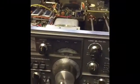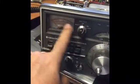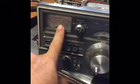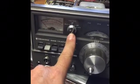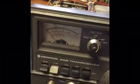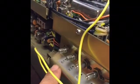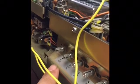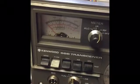The problem with the TS-520S was that in the RF position on the meter, I wasn't getting any meter deflection at all. I was seeing ALC, I was seeing plate current being drawn, but I wasn't getting any RF output. When connected to the dummy load, I was only getting about 3 watts on my external meter. The first thing to check is the RF volts adjustment on the side door, but that gave no indication of any adjustment at all — so there was a problem with the metering circuit. We diagnosed that and successfully fixed it.